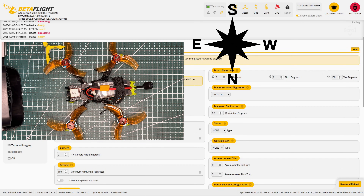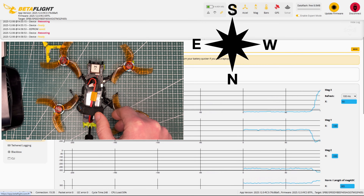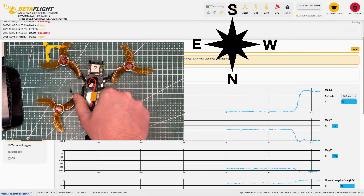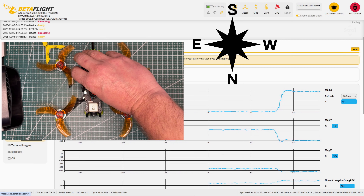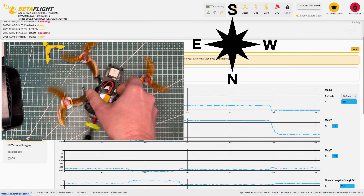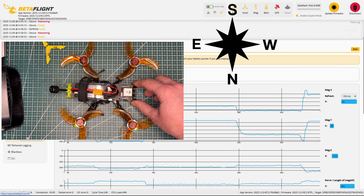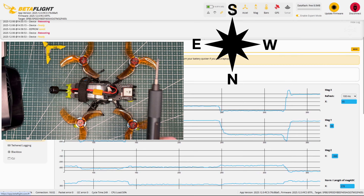Since this part is trial and error, let's try adjusting it. I set 90 degrees flip, save, reboot, back to the sensor tab, and check again — now everything is reversed. The X-axis facing south shows the highest values, and when it faces north it shows the lowest values. Same thing on the Y-axis: north is low, south is high. Basically the entire compass is 180 degrees flipped.